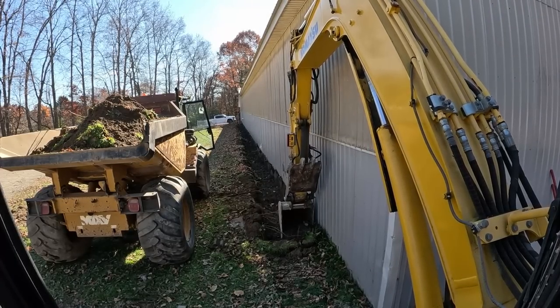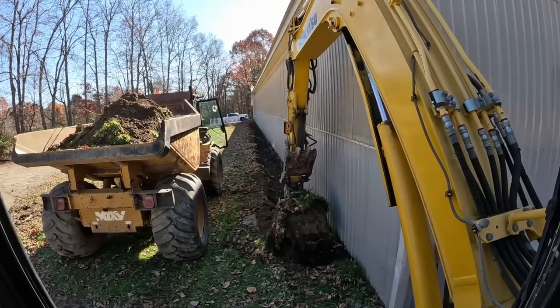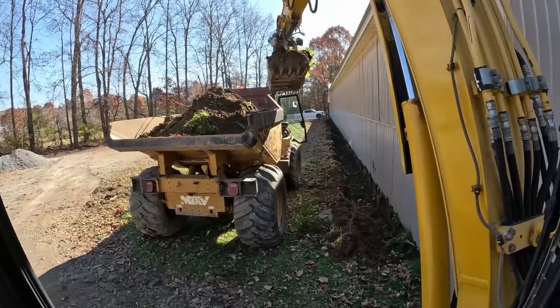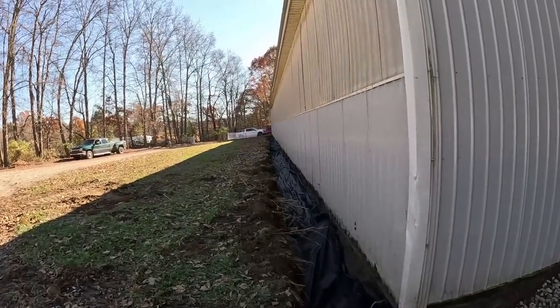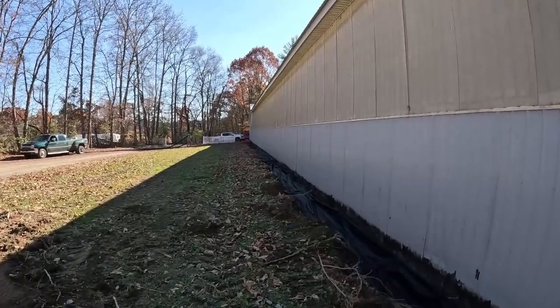We're in better position now - I'm going to pull right through, straight, not looking at it - like over the tracks. Fabric is all in, everything's pitched. We double-checked it even with the stick. Throwing the pipe in now. Over here right above where the gable meets, we get tons of water here. We made a big box here with the loop, with the pipe - fill that whole thing with stone and right on out.